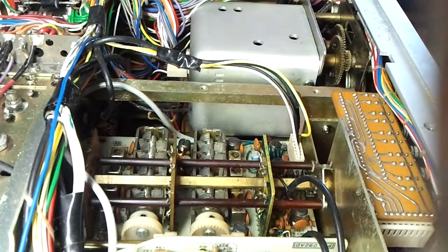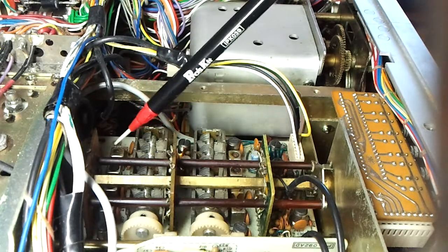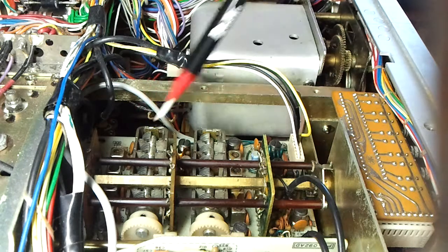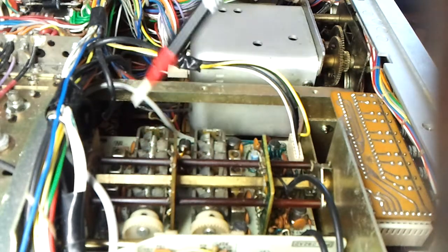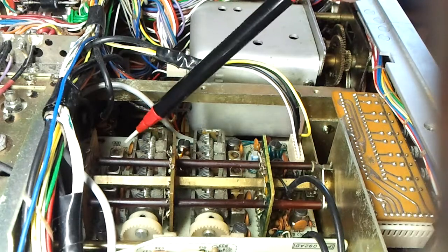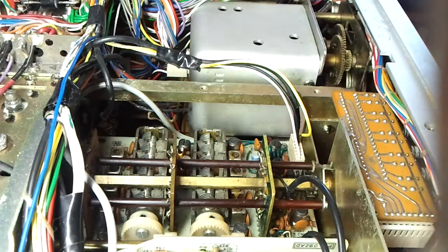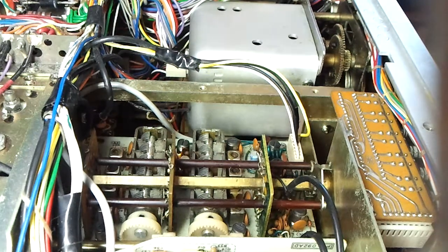At the moment we're on the 80 meter band on 3.6 MHz. The order of the coils is that 3.6 is up the top. The first band on this is 15 MHz for WWV, then it goes down to this end for 7 and then 14, 21, 28 etc. In the history of this transceiver, one of the 3.6 coils has been damaged or replaced — it should be one of these — so that's actually non-tunable. The only one I can tune on the 80 meter band is the output of the RF preamp.